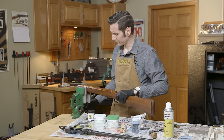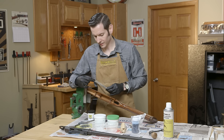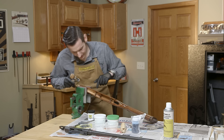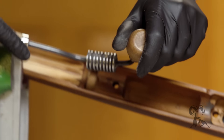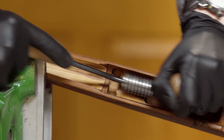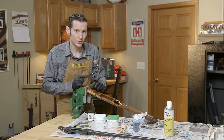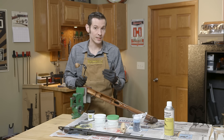When I did the barrel channel itself, a tool I found very useful was to take some sandpaper, wrap it around the handle of a hammer — that gives you a nice round surface to follow the contours. Moving back, I'm going to use this barrel channel tool and just remove material from around the main contact points where the Acraglas and the action are going to be. When removing material from these areas, don't take too much out because that'll make your action want to dip. We're just taking off the surface of the wood to give us a nice good surface for adhesion of the Acraglas.